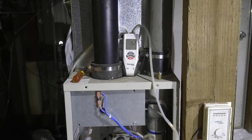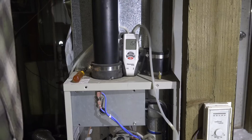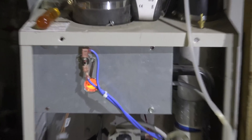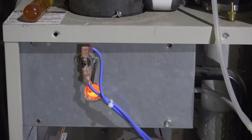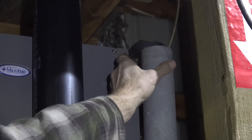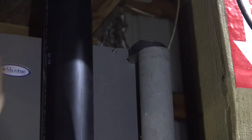Back in the same situation, I have 1.51 inches water column differential pressure. But there's another way I can get this thing to fire. I just moved this little magnet that's hanging on to the plenum back and forth to get the right vacuum — and now we're over 1.7 inches. You can see the hot surface igniter is on.